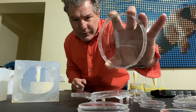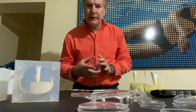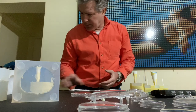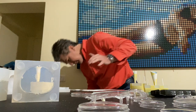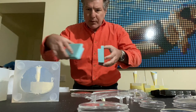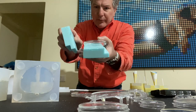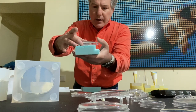The process is called replication molding — you need to have an original piece so your mold can be made against that surface. Here is a mold I made in silicone. I made a square box out of styrofoam just with tape around it, placed the original part glued on the bottom, closed the walls off, poured the silicone, and let that cure for a day. Hopefully you don't have bubbles.